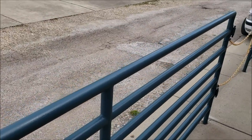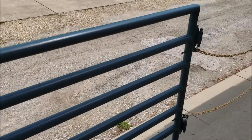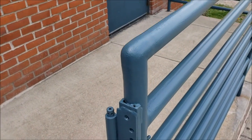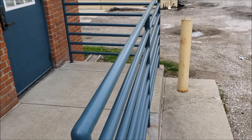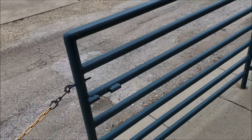We've just about wrapped up the handrails. This is the loading dock and kitchen exit handrails. It's kind of overcast and I'm getting a lot of glare on the screen, but you can get the gist of it. These were peeling and had rust all over them. This one here, I stripped about 95% of it down to bare metal because it was peeling and so rusted. This one over here wasn't quite as bad — I left some of the existing coating on since it didn't have as much rust, but it was peeled, so I lightly sanded it.